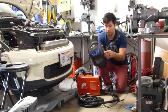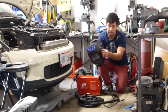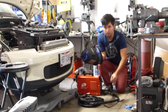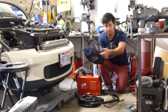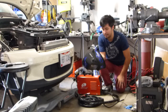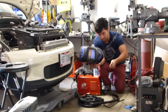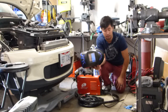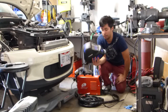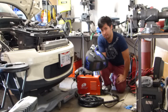This helmet goes from grind — basically just a face shield — and then I turn it to 9 when I do my plasma arc cutting, and all the way up to 12 when I do my MIG or TIG welding. That gives me the best protection but still lets me see what's going on. When you start cutting, especially something thick, your spatter will actually shoot back at you. And if you go too quickly, it'll also shoot back at you. That's why I recommend the face shield rather than just the glasses.